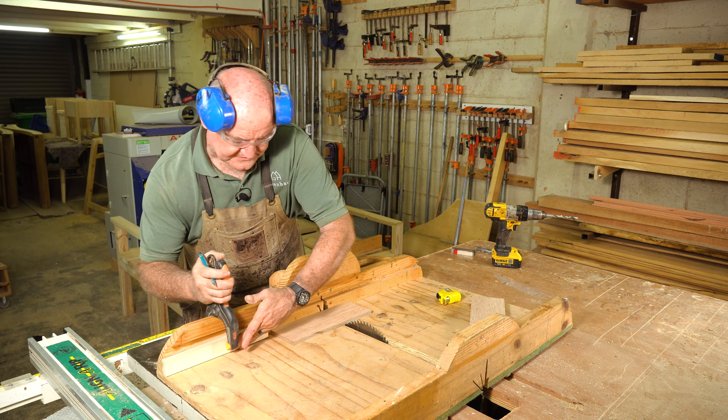We're back at the table saw. Our cross-cut sled is basically some plywood that's nice and sturdy with a fence on the front and a fence on the back, and that helps us cut nice and accurate. The first thing we're going to do is measure 200 mils from one side. We're going to set up a stop block up against our blade so we know we're going to cut exactly 200 mils. Now all I have to do is switch on the table saw and push this through. It's nice and safe, nice and easy.